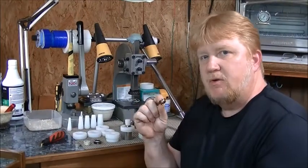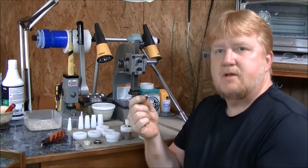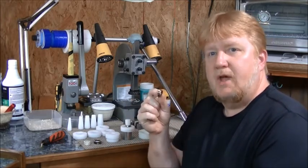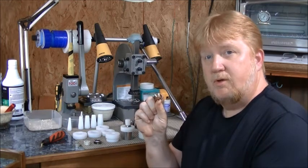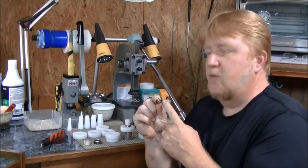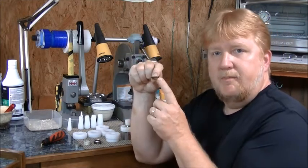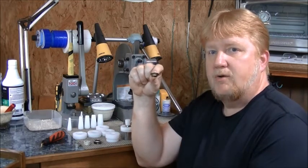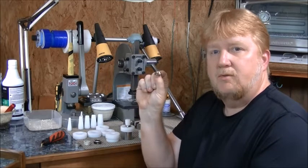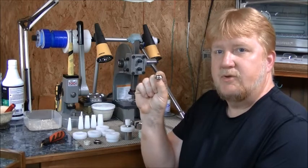A little something to remember: this is a 17 degree fold on a presidential dollar, and some of you may think you could straighten that out on this wall straightening system — and sure you can. Make sure before you do that, you open up the cut side with your ring stretcher like you would any other ring. Place it cut side down, open it up, and stretch it out a little bit prior to doing the straightening system. Turn it over, use your expansion cone, place it down in there and stretch it. Always anneal before doing this after you do a ring stretch.